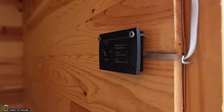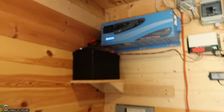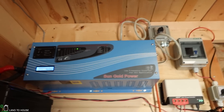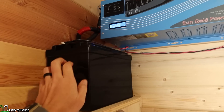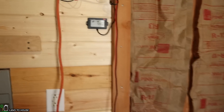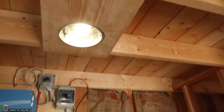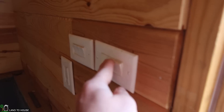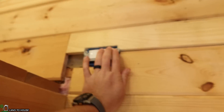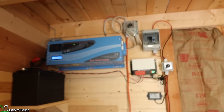There's no power being consumed, so I need to turn on my inverter switch — power saver off should do it. This is the same kind of inverter as the one over in the house. This is a 3,000-watt SunGold Power inverter, and it's got a little display showing 13.9 volts on the battery. This is a lithium-iron phosphate battery, and now we've got 44 watts coming in from the panel because this is consuming power and I've got some lights on in here. Let me go ahead and flip on a bunch of lights and we'll see how much power comes in from this panel. About 112 watts coming in now — you can see that is running those lights quite well.